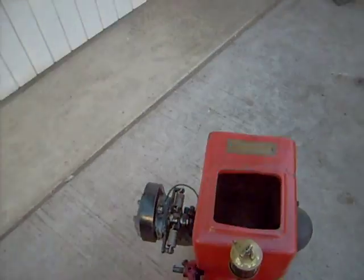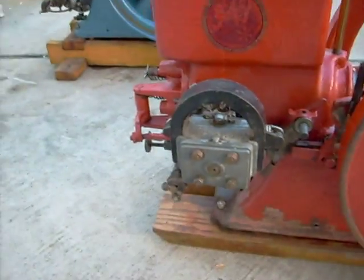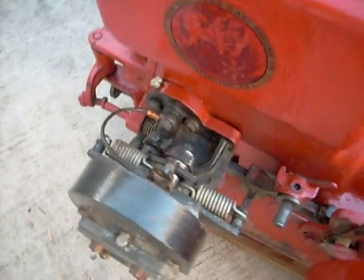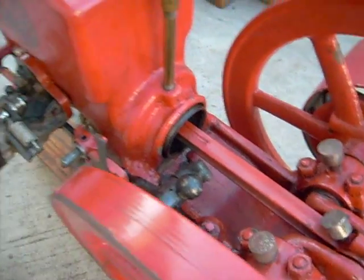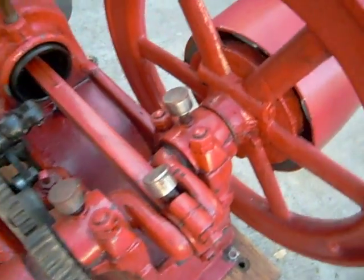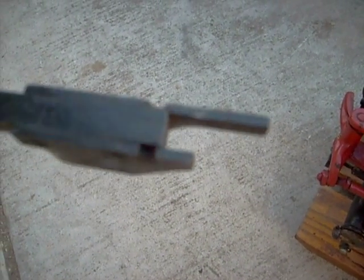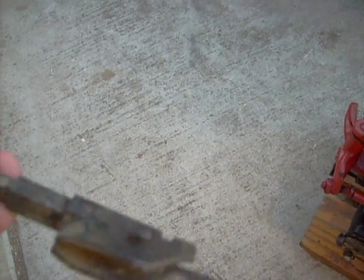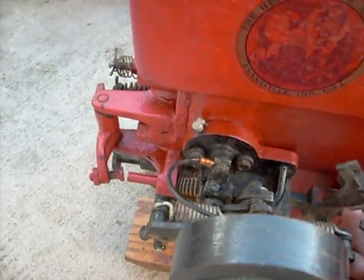Here's a Model F one-and-a-half horsepower economy engine. It's got Hercules decals on it right now, but that's to be fixed. It has the later style Webster magneto on it — you can see back in there. Everything's pretty much normal on the rest of the engine. Unfortunately, this one suffered a broken guide mechanism on the magneto for the trip finger. Max has already got some replacement parts ready to go, and this unit slips right in here like this. You can see where that was broken, but that's to be fixed post haste, so this will be a perfectly running engine.